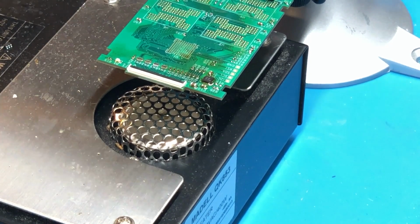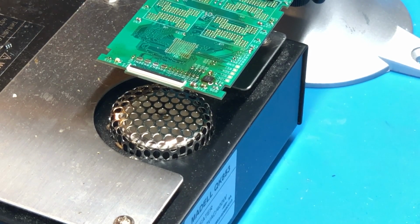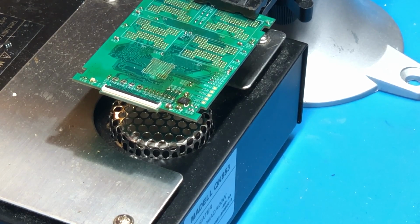And just like that, it looks to be completely soldered. So that is the complete installation of all the passive components, plus the LED and connector. So now I will prepare the board to install the controller, the SM2236, as well as all 4 NAND ICs. I've already got that pretty much ready to go here. Just keep it on the board preheater. But I do need to take the nozzle off the hot air. So I'm going to pause the video here, let everything cool down, and then we will begin the process of installing the ICs onto the board.